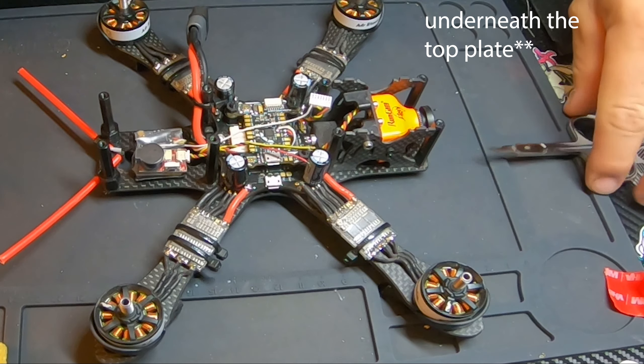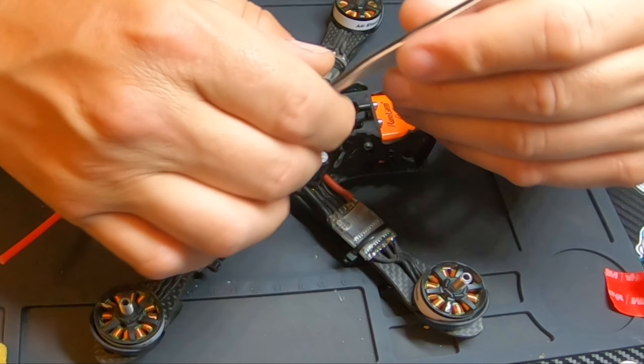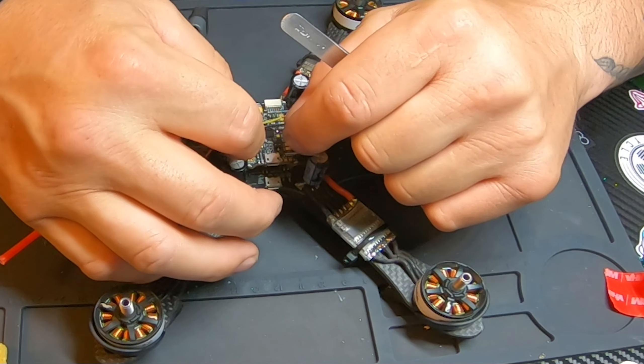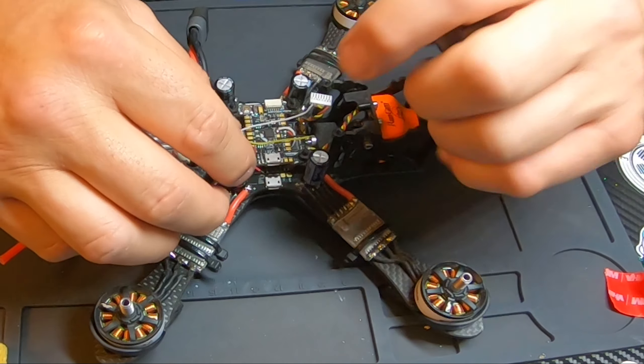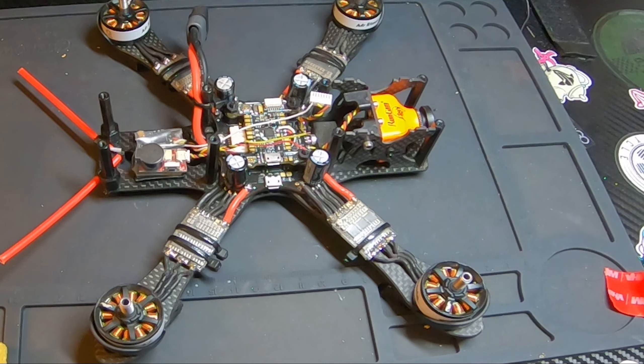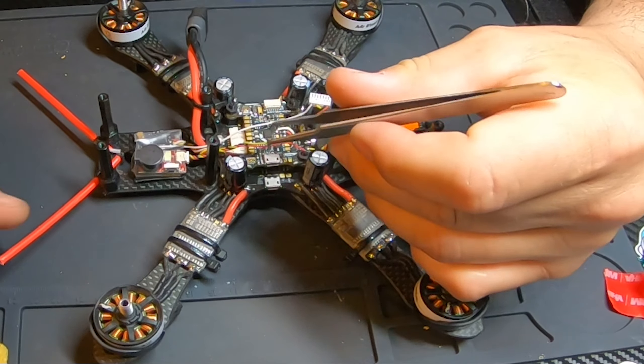As mentioned: the yellow wire goes to buzzer negative, the red wire goes to buzzer positive, and the black ground wire goes right behind it. We'll start by snipping the wires down — bring the yellow wire in, cut it with a little extra, then the positive the same way. If you do cut it a little short, just unwind the wire slightly and you'll gain that extra length back. Try to get it right on the first try. The black wire is your ground.